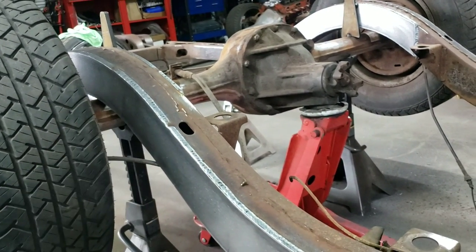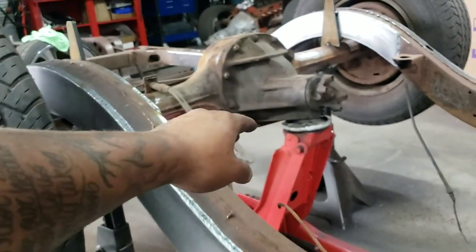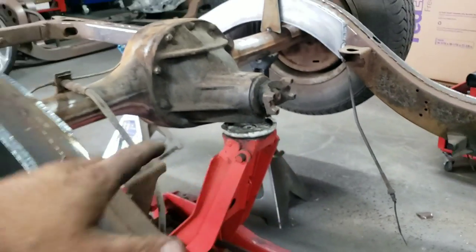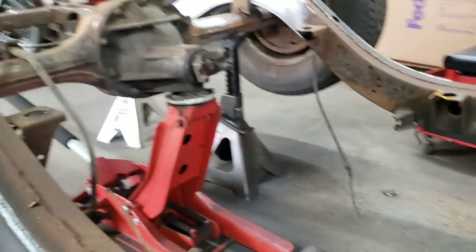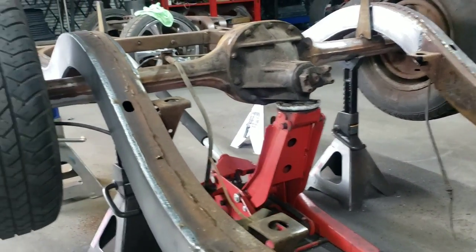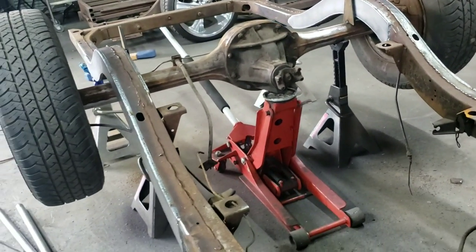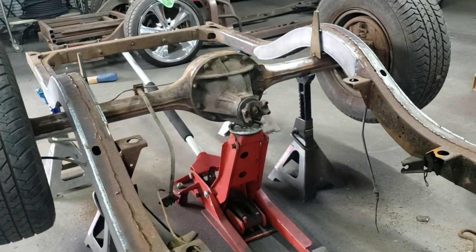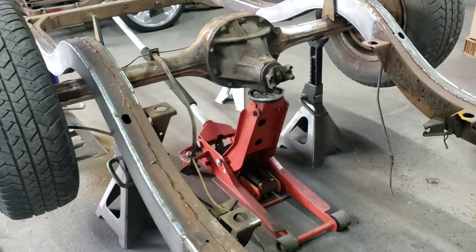If your arms are shorter, it's going to give you more of a pitch on your rear end and on the pinion. This is the pinion when I refer to that right here. You normally want this pinion angle within 3 degrees at driving, and you don't want it to be binding. So, of course, everything we build, we like it functional. We like it to work in all positions: up, laid, fully locked up, fully laid, driving height. We want it to be all working. So that's the fun part, is getting all these measurements correct.